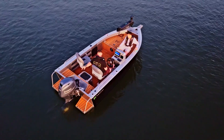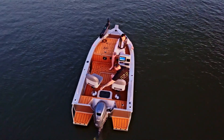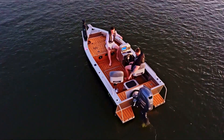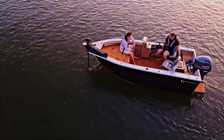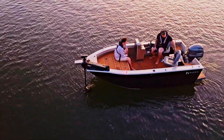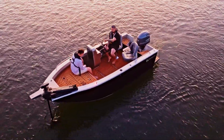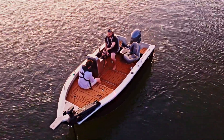I've got my house battery down the back in behind these flaps. Underneath the standard bench seat you can use it as a bit of storage, so we housed all the plumbing and the house battery underneath and put canvas covers on with press studs — it finishes that back off nicely. And then we've got two lithium batteries up the front here to run the electric motor. It's a good idea to always have dedicated batteries for that because it draws quite a bit.